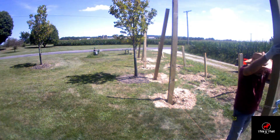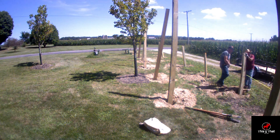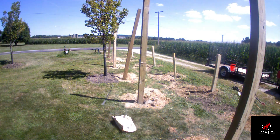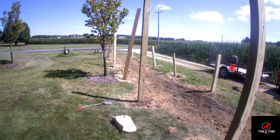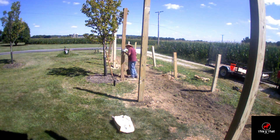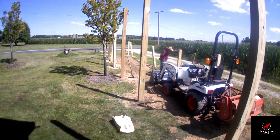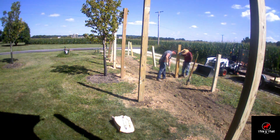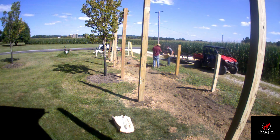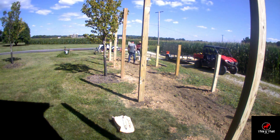This is okay but none of it's overly difficult — it's just kind of a tedious process making sure everything's plumb and square. The way I had to set up here is that I had to be south facing, and where I'm at the optimal angle is really 41 degrees, which is better for winter because the winter months here in Northeast Ohio are pretty terrible as far as sunshine is concerned. That's another reason why I kind of oversized the system.